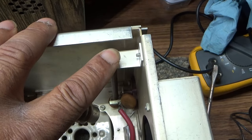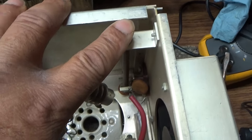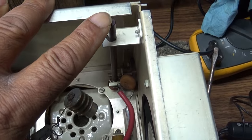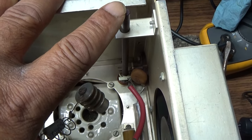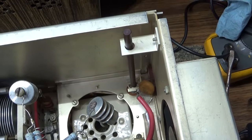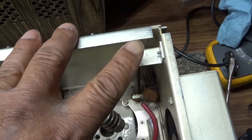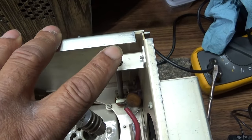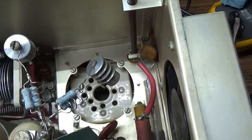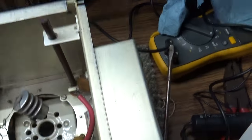There is a crowbar — if you don't have the lid on this amp and you keep this circuit intact, it will short out the high voltage completely. So it's trying to make this amp dummy-proof: if you don't have a lid on it, fire it up, and you don't address that crowbar switch, it's going to take that high voltage coming in and short it right out. Another thing that keeps you from killing yourself.